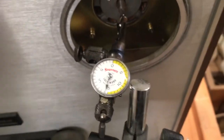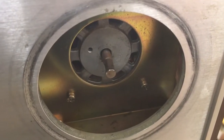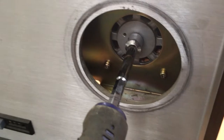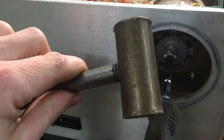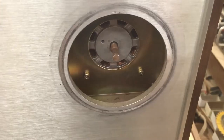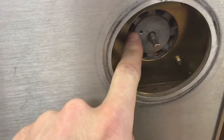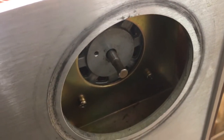So I've been messing with this. I said I was going to stop at a thousandth, and I think I'm close enough. I didn't film the process because it wasn't very exciting to watch, and it was rather tedious. What I did was I found the high spot — you see some Sharpie lines on there, those were my changing high spots. I'd find the spot pointed up the highest, then just using a 3/8ths nut driver — the inside was just the right size to slide over — I would put a little bit of pressure on the handle and tap it with a little hammer. Very small increments. Slide the indicator back, test it again, repeat. I managed to take all but a thousandth of that runout out. I'm going to call it good, because when I'm hammering on this I'm putting pressure on cast aluminum trying to bend steel, and I really don't want to crack this motor housing. But I was careful, I snuck up on it, and I'm pretty happy with that.